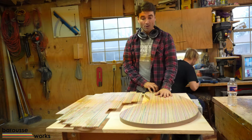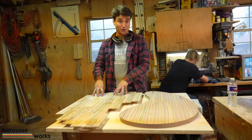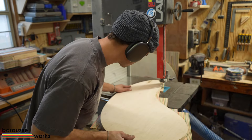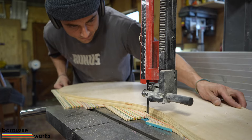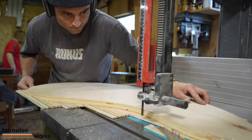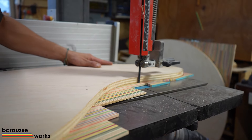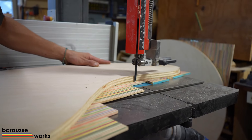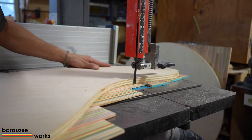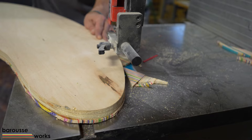As you can see here, we've gotten the bean table glued up, and fast forward — it'll look like this. This is what the top is going to look like. The steps you're not seeing: we use a router to trim everything out to the exact shape, then we add an edge banding, then we flatten and fill all the voids with epoxy, and then we sand up to 320, which is where this one currently is. Today, we're about to put the legs on. We're going to let this one cure and glue up, then move to the next step on another day.